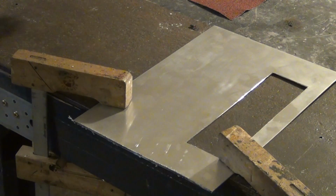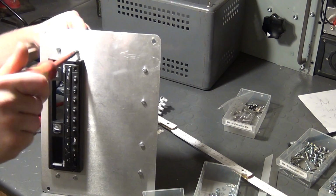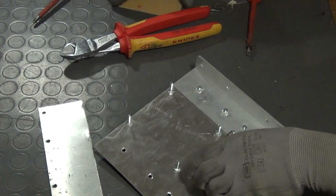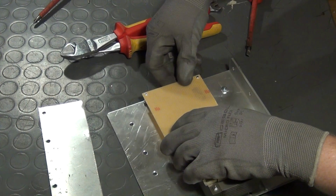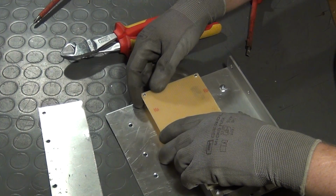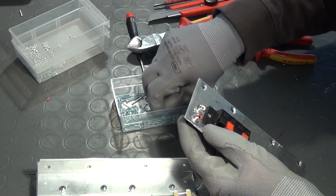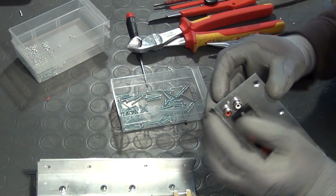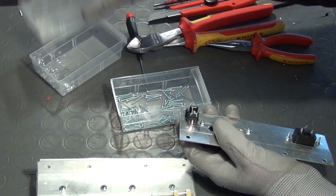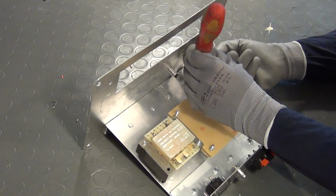saw and cut some aluminium sheets in order to make a front panel into which the car stereo can be inserted. Then several aluminium pieces have to be worked on to make a base plate that will hold the transformer and power supply circuit. An additional aluminium sheet will act as the back panel, holding RCA jacks, connectors for the loudspeakers, as well as a jack for the power cord and a BNC jack for the antenna. Why BNC? Well, I simply don't have anything better.